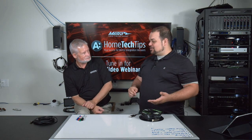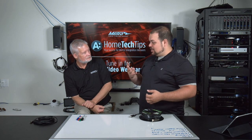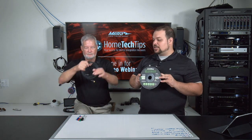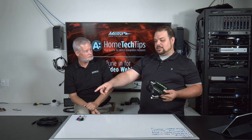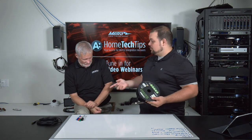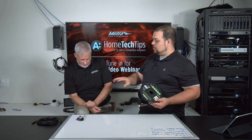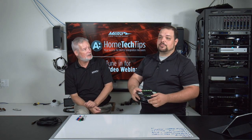But now in HDMI 2.1, we will have 4 channels, and that's what this cable here, our AOC cables, support. In fact, it's not just this one, it's all of our AOC cables: the detachable head shell for the install bay, the non-detachable head shell, and also our Helios and Velox as well. Yes, those are all 4-channel compatible, so they will be able to run 6 gigs per channel on all 4 channels. So right out of the gate, they're 24 gigabits without a problem. Right, so you won't have to worry about that.